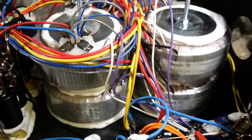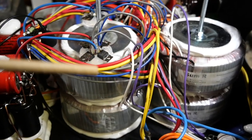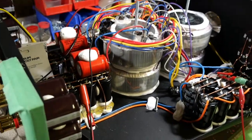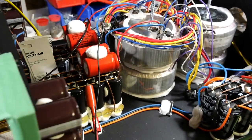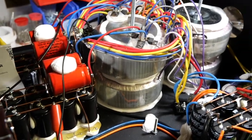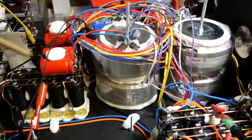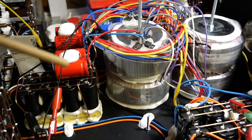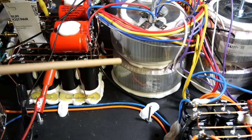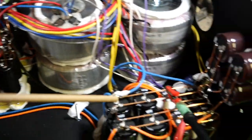There are four transformers in total. They are in parallel dual mono amps, two of them per channel. Usually if you have a big inrush current bang on the transformer you will hear a ding sound when it turns on, but with a proper soft start — even at a total of over two farads of power supply in this amp — there is none of those bang sounds. By the way, this is a paper straw and I will be using it to poke at things safely.